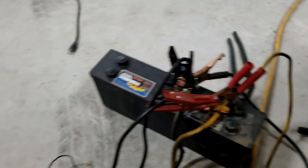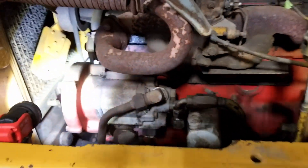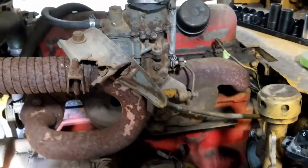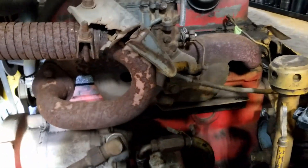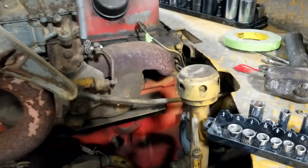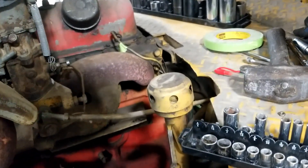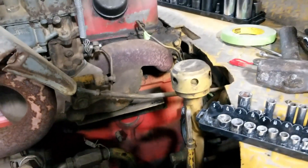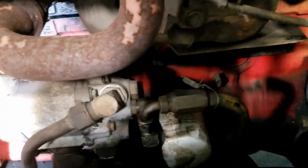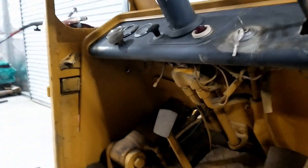What that means is the motor is seized up a bit. I might have to take off the head to try and get it to loosen up — good time to change the head gasket and also check the head, make sure that's good. I'm probably going to have to rewire it. I doubt I'm going to find a wire harness for that year. It looks like what they did was go crazy with the paint and painted everything, including the wires. So it would be either a matter of testing everything or just changing it all out. It's not that many wires. The gauge looks fairly new.